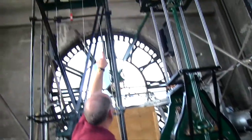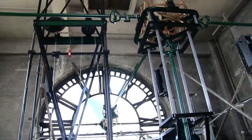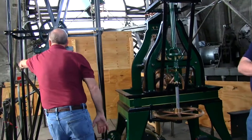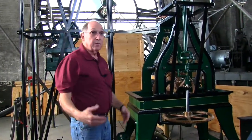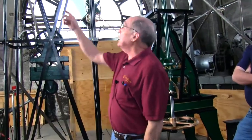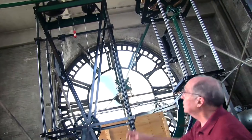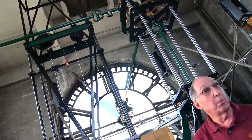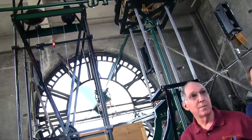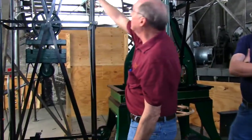Normally, this track is about 10 feet up. All these sprockets on top — the chain was driven from here to that first sprocket and down, and then the weight was all a continuous chain system. The auto wind was mounted here; it would wind this weight up and down. Problem is, there's no place to attach the track at that point. The installers added another section to attach it to the ceiling, but left all the sprockets on the very top — so all the chains had to go up to the top. With that much chain hanging there, it was difficult to maintain. We suspect a lot of those bearings didn't get oiled, the chain slipped off, the weight came crashing down, and all of this stuff got smashed. The midsection got smashed.